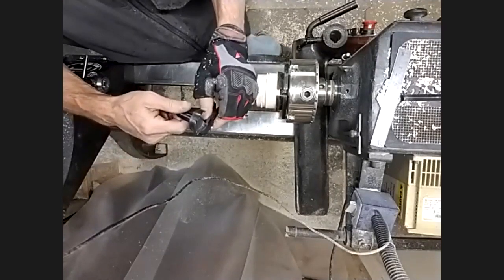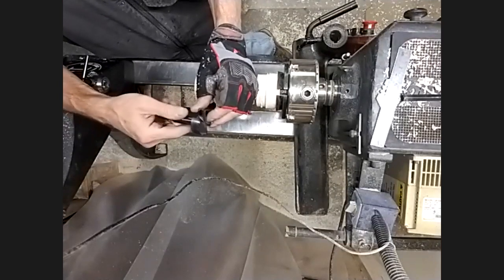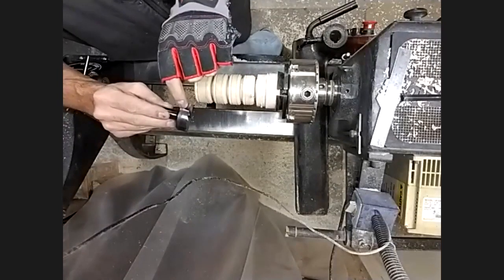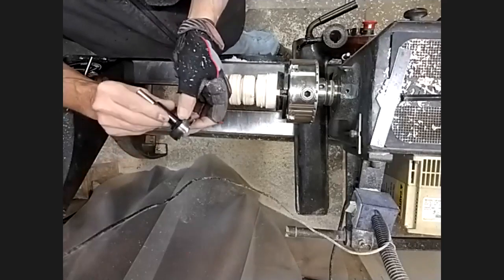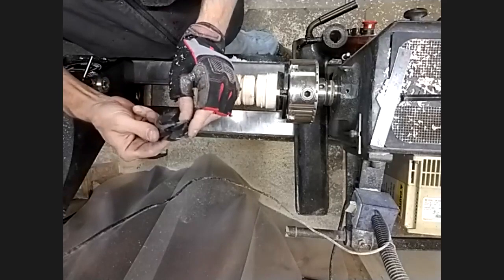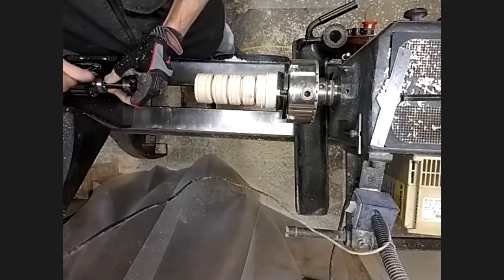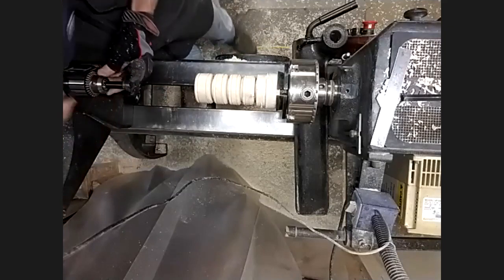Same thing as when we're talking about flattening, where flat work merges into round work, same with Forstner bits. As they come to you from the hardware store, right from the manufacturer, they come to you dull. They are not sharp. So you need to flatten and sharpen this inside face. Once you get that taken care of, then you've got a proper edge on your Forstner bit. And you'll know you've got a sharp Forstner bit. You can start getting pencil sharpener like shavings when you're drilling.